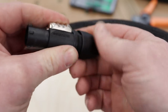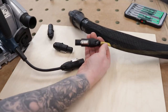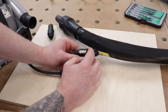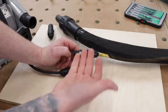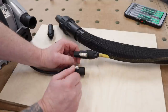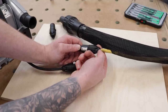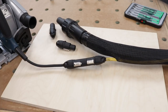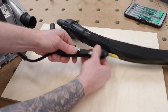That's the socket all closed up. It was a little bit of a squeeze - this is a 2.5mm cable and these connectors are rated for 1.5mm cable, but the connectors are big enough to accept a 2.5mm as you've seen. With the ferrules on top, the terminals were more than big enough to take it - just a little squeeze to fit through the end grommet. Now it's just a case of joining the two together with a half turn or quarter turn, and that's your quick couple done. Pull back and twist to disconnect.